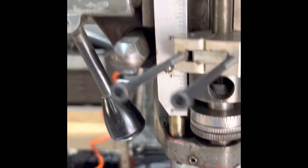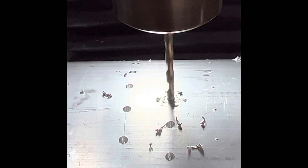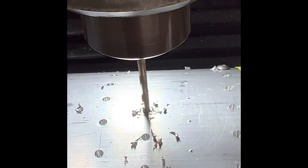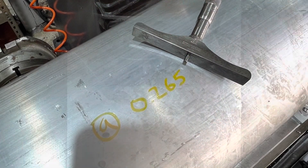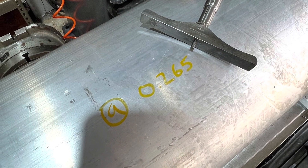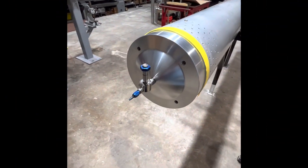This is set up in the mill for drilling. I've got the depth stop set, so it's auto-fed down and then the clutch will pop, and then you'll see me hold it down flush for a following couple of seconds just to achieve that proper drill depth. Then it's all checked with a mic to make sure we're at the correct depth. You can see we're all drilled and depth-checked on all the holes.